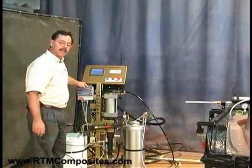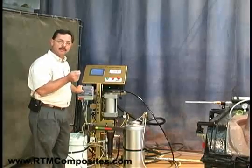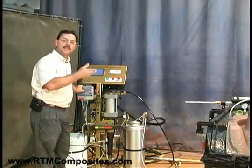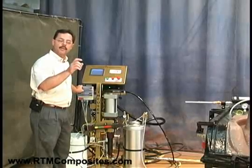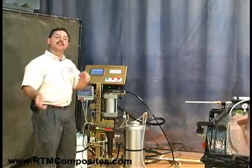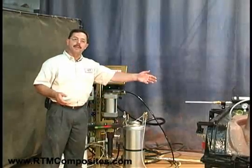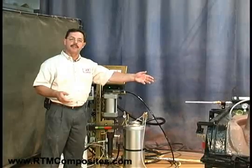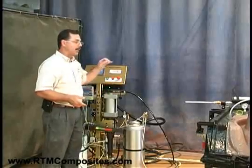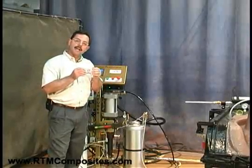We also have an in-line mass flow meter on this model, which tells us the exact amount of resin that's gone down the line and into the mold. It also tells us specific gravity — if we're running filled systems, it will identify that we have the right filler load by specific gravity parameters set for high and low tolerance. Over the years we've seen operators either put in the wrong amount of filler or let it settle to the bottom of the tank, so they end up pumping mud, causing repeatability problems. By setting parameters around specific gravity, we know the filler load is constant. With constant temperature and constant filler load, we can then inject at a specific controlled rate.